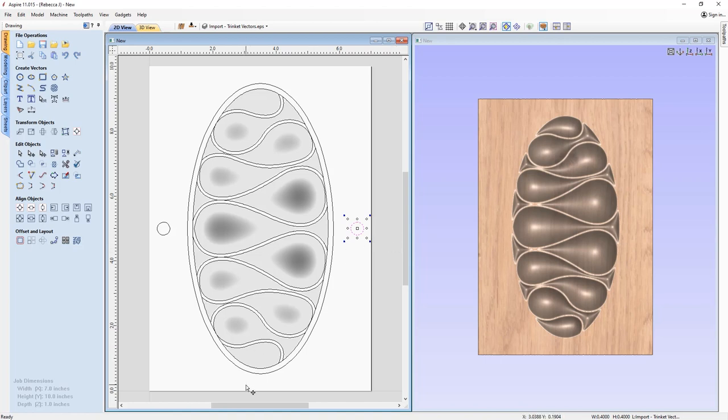You might have it set up in the software to flip from bottom to top, but in the actual physical world you might forget about that and you might flip from left to right, because they're actually going to align anyway because they're in a symmetrical pattern. So the way to avoid it, and a real fail-safe way of aligning your material so there's only one possible way for it to flip over, is by setting it up in an asymmetrical fashion.